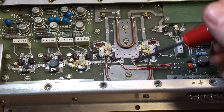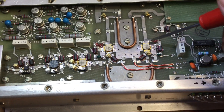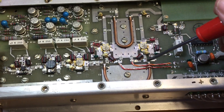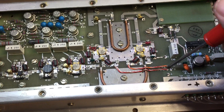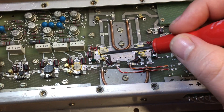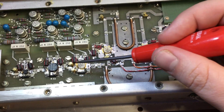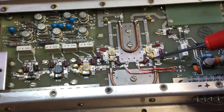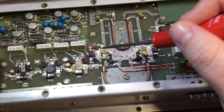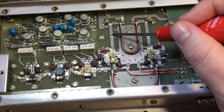The two transistors amplify in parallel, and the signal is fed out through DC blocking capacitors and RF coupling caps. Collector voltage is uniformly supplied to the collectors of both transistors, and two biasing networks supply bias current via RFCs to the transistor inputs. Without bias, these would operate in class C, but with bias applied they are class A/B. Two tuning capacitors allow impedance tuning to match the Q of the transistor inputs, and after the RF decouples across these capacitors it enters two more tuning capacitors which tune the strip lines into the output transformer.